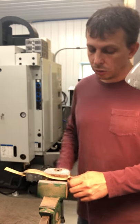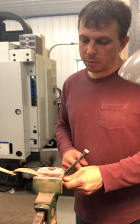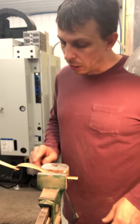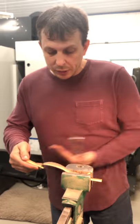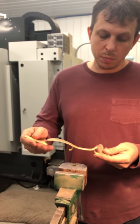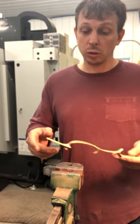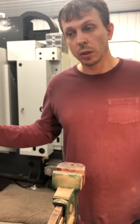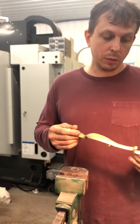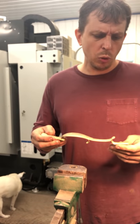You can also be a little creative in how you clamp the part up in the vise. You can sometimes shim it a little bit, wrap leather around it, and squeeze it and hold it and pinch it and file all these surfaces. These little facets and flats all over it need to be addressed and filed, and basically you go about the same procedure we used on the butt plate. Same thing goes with the ramrod pipes and side plate as well. The side plate's pretty fine since it's machined, but there are some real fine machine marks that need to be removed.